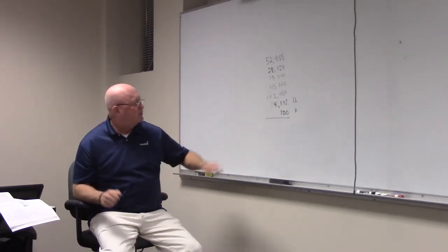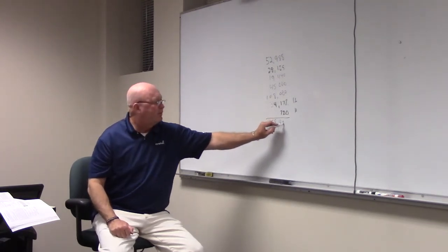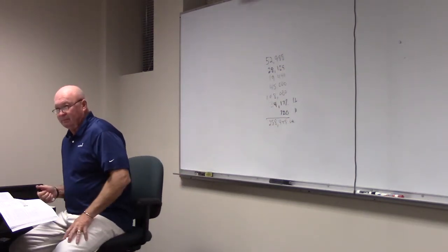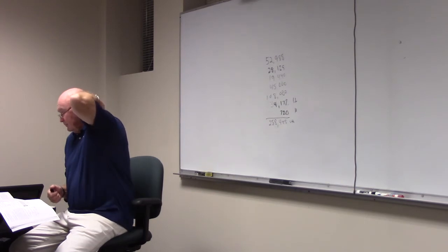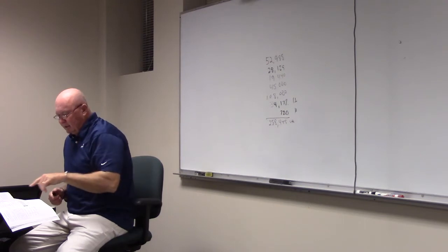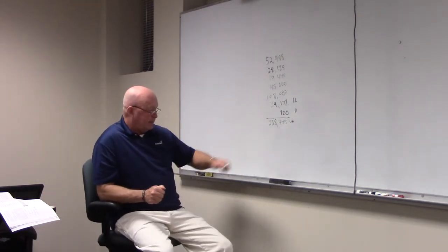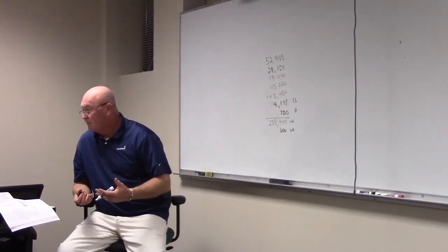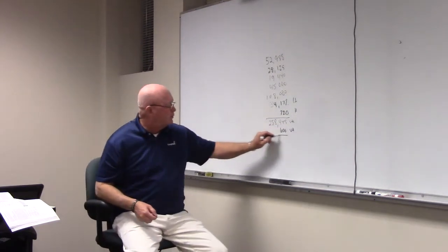Okay. All right. Add all this together, and you should get what? 288,445? Yes or no? Okay. Yeah. All right. Now it tells us that there's actually a continuous load. These lights outside are continuous load. So our continuous load for the house was 2400 VA, so we're going to have to add that to that, which is what, 600? Those lights are going to stay on at night, aren't they? So they're going to be on for more than how many hours? Three. More than three. So then that gets a total of 289,